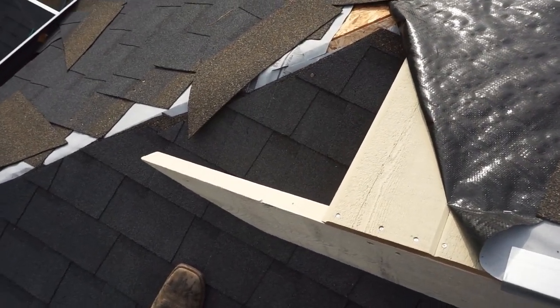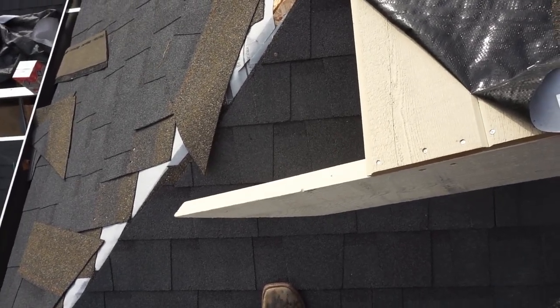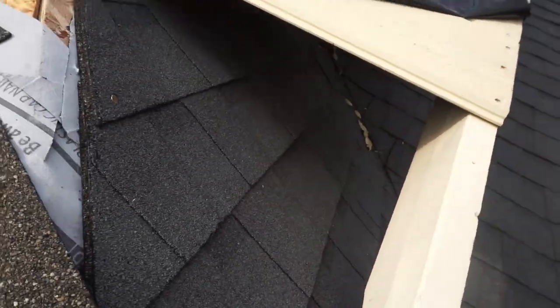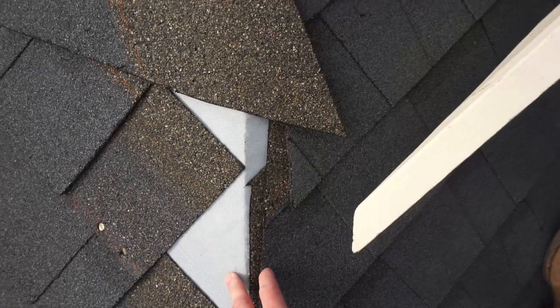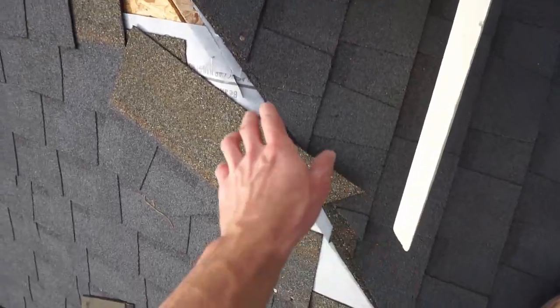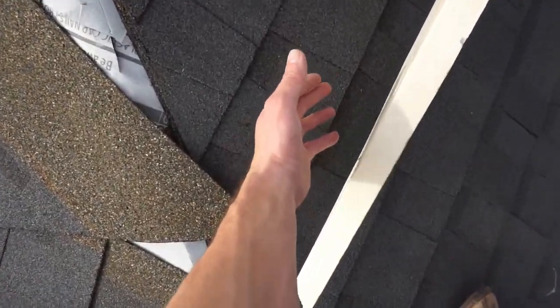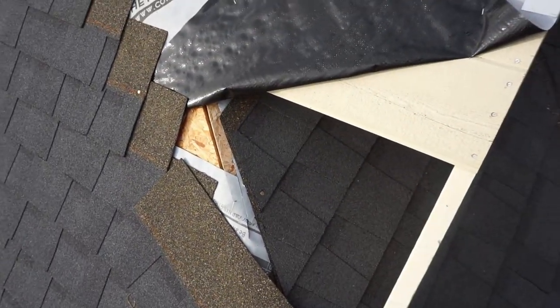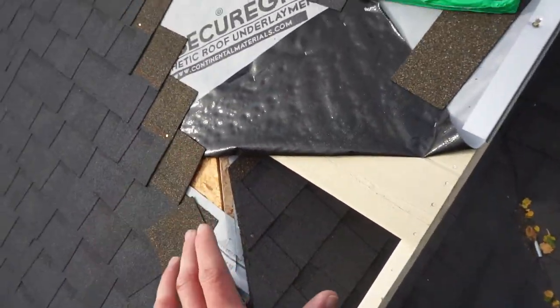This corner looks unfinished as far as the eaves go, but I'm about to explain exactly why. One important detail on this roof — we didn't finish the roof sheeting and all of the V-Rustic for the eaves on purpose. It's corners like these where we have overlaps. Now that the roofers are here, it's time for them to finish this up. What's going to happen is the roof material is going to come under where this eave will be. If we had capped this off, they wouldn't get this roof up and over, which would potentially leave part of this exposed. So letting them do this corner first and finish that up, then put the rest of these eave pieces on, like we're about to do, and then seal up the top — that will finish up this corner.